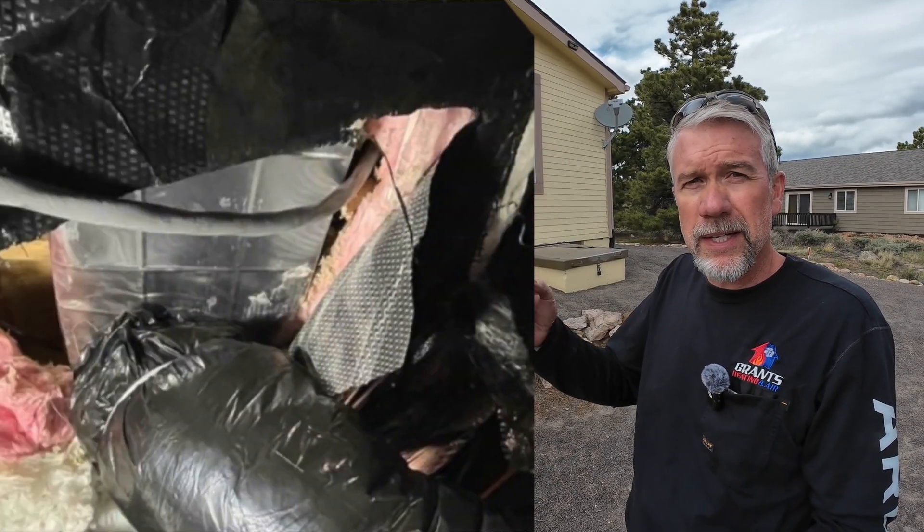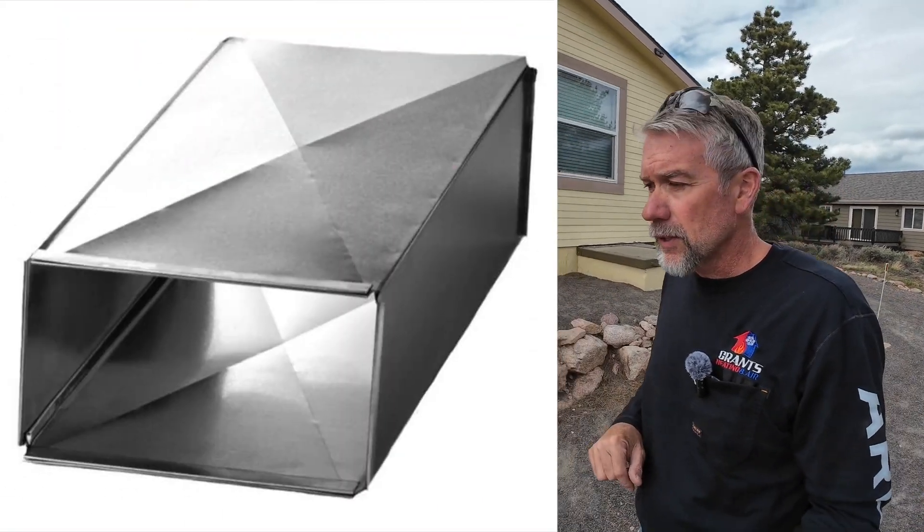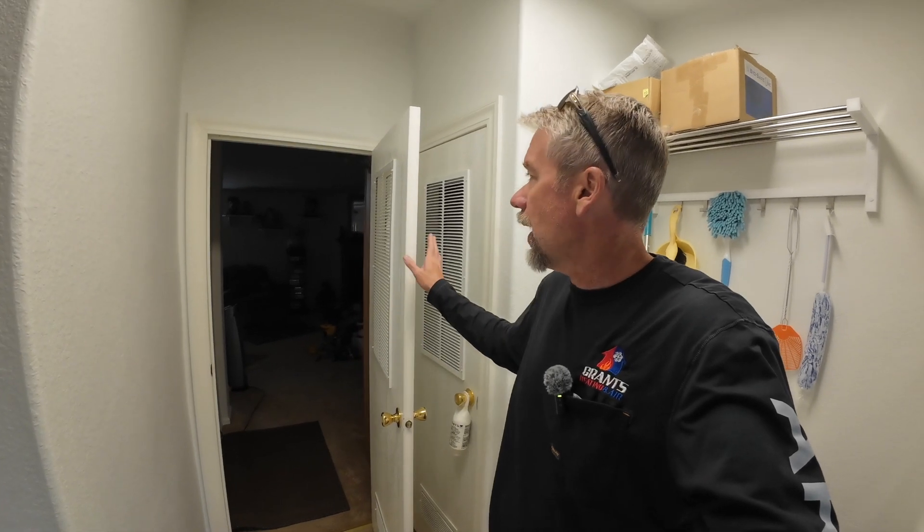Manufactured duct is very small and I'll show you a picture of it here versus the standard residential duct that we're used to dealing with. Let's take you guys inside and go take a look at how we did the air handler inside. It's important that you have louvered doors. Manufactured home furnaces, at least most of them, do not have return air duct work.